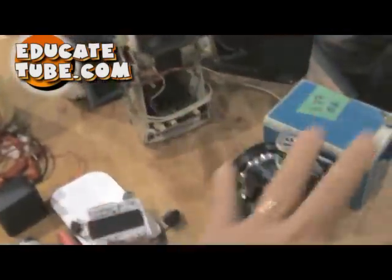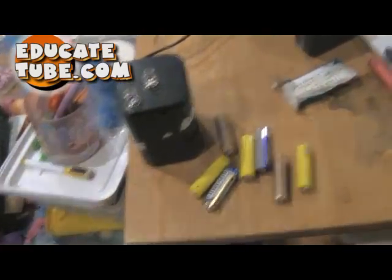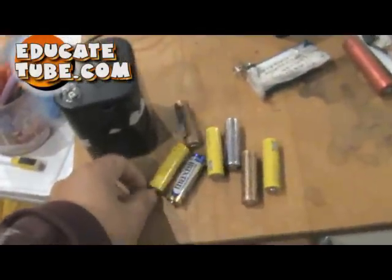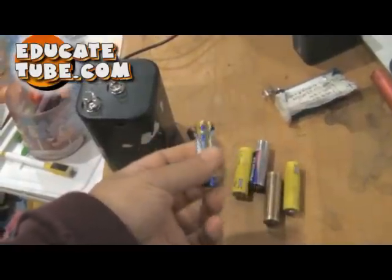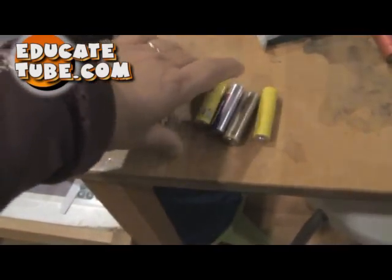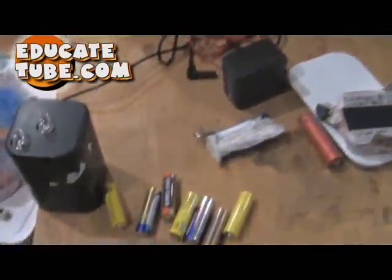If you're not fond with lithium or lead-acid, you can move towards alkaline — you can use a 6-volt alkaline battery. But it's a bit more expensive; I wouldn't recommend alkaline because they're only one-time use. You'd rather go with lead-acid rechargeable or lithium rechargeable batteries — they're much more environmentally friendly. However, once alkaline drains out, you can still use it for solar lights in your backyard as a rechargeable battery. If you connect 4 for 6-volt, or 6 or 8, you can get from 6 to 12 volts and power these audio speakers. So even alkaline works.